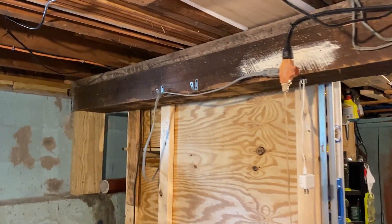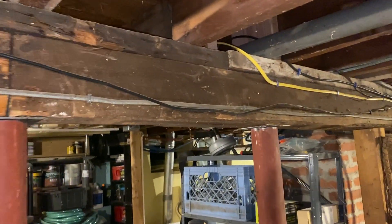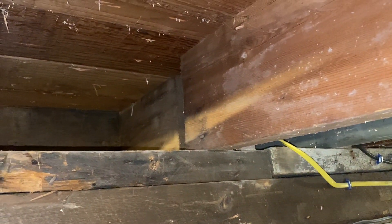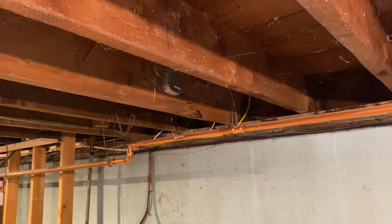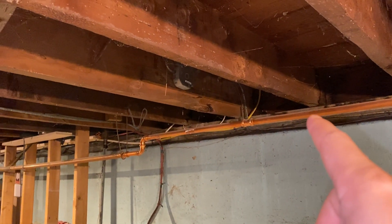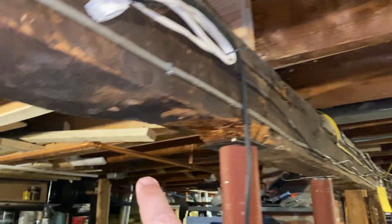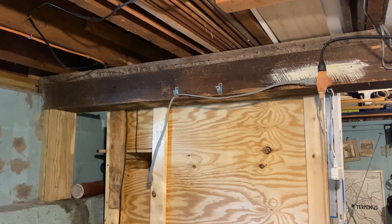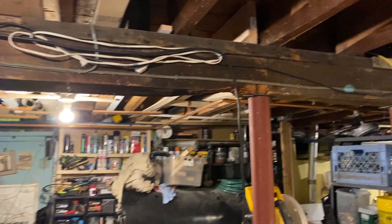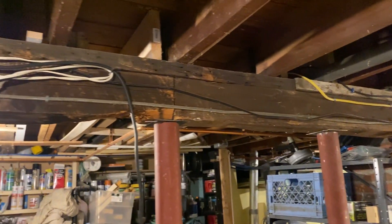Now I'm in the basement underneath the living room and dining room, and you can see there's a beam right here that supports these joists. You can picture the floor above was very similar to this. So you have the joists that sit on the sill out here — that is your outside wall — and they go to a center wall right here, and then another joist goes from here all the way to the other outside wall. So if you do have a beam like this in your basement underneath a wall that you're looking to remove, more than likely it is a load-bearing wall.